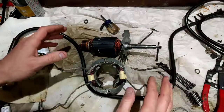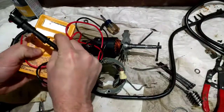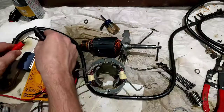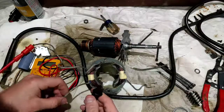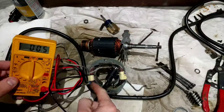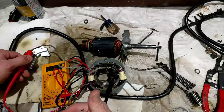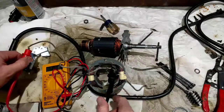I had some other thoughts to analyze this, so I grabbed a common multimeter. Remember kids: get the cheapest multimeter you can afford because you're going to burn it out while you learn. I want to see what the resistance of this coil is — no power, nothing connected, no other circuits, no batteries. Those are all great ways to fry a multimeter if you try to measure resistance with any kind of power. So I'm going in through one of the input wires — if you believe what I've told you, it goes through this coil and out the other side.